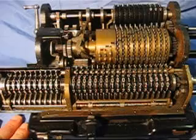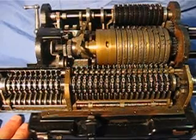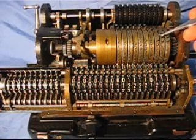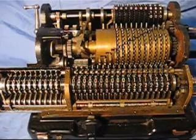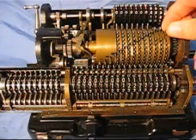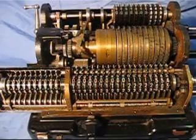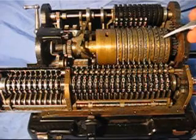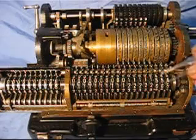Now remember, what we have here is 222 set with these three settings dials. Now I'm going to turn the pinwheel, and let's look at the bottom of this thing. I don't know how well you can see it. Here's a tooth, here's a tooth, that's two. Two teeth on those first three settings dials. So if I turn these up one more, to 3 on each of these, and turn the drum over, now I have 1, 2, 3, 1, 2, 3, 1, 2, 3. These teeth catch these gears and advance these dials.